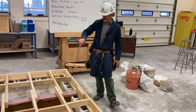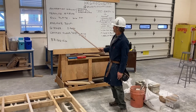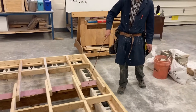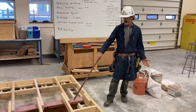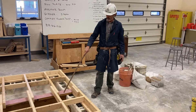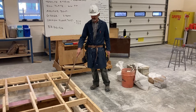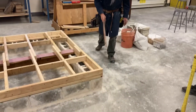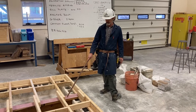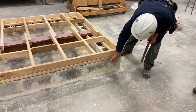In most cases around here you'd be using a steel beam, also referred to as an I-beam. We could also use a laminated veneer lumber (LVL), a built-up girder, or sometimes just a solid wood girder — so that's another term you should be familiar with. After our girder is set in place, our sill plates or mud sill is installed.